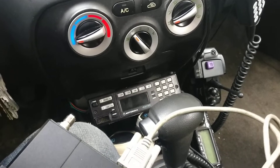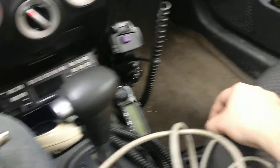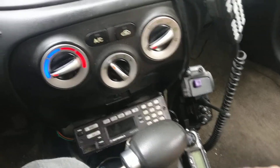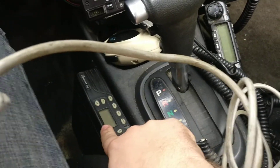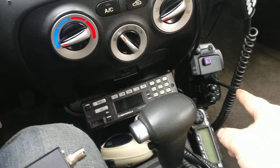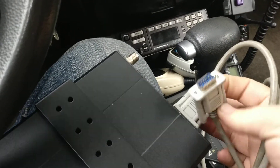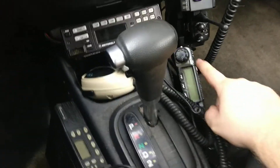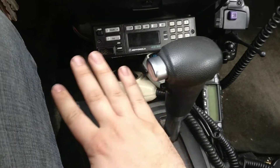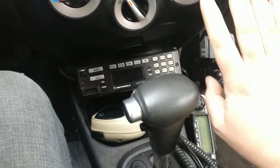When I just need to walk around a park or wherever I'm at, I can flip a switch to turn on my repeater. I'll have a little two-to-four-way switch, maybe under the seat, that I can flip — so I can talk on 70 centimeters and come out on a 220 repeater or a simplex channel, a two-meter channel, or 900 megahertz, all from my 440 UHF portable. I'll basically have this running to one of those switches, then make a cable from the back of that switch to each of my mobile radios. There is a modification for the 220 to put a DB9 on the back, which I'll take advantage of. The Motorola gear is made to do that. I'm just going to cross-band, so I don't have to worry about in-band.